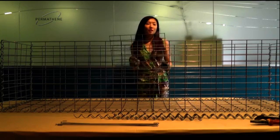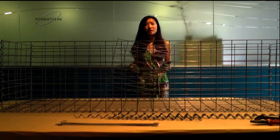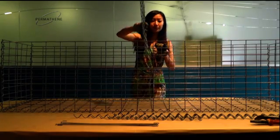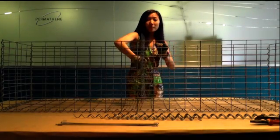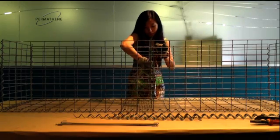This is a baffle panel. Always have a baffle panel at one meter distance. So for this cage, we place this in the middle. The baffle panel is a crucial component for a stable gabion.